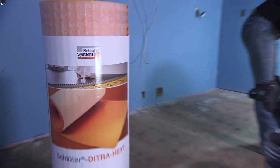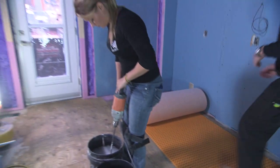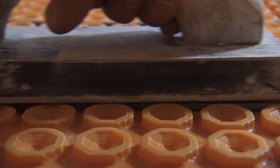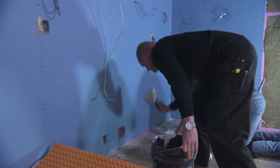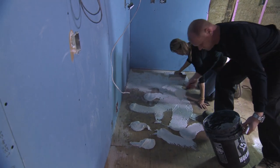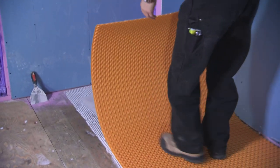Schluter's a smart company. The ease of putting in a heat cable system within the Ditra — called Ditra Heat — it's two things in one. It gives us that uncoupling membrane on the floor and allows a cable to be snapped in place, removing that secondary system, whether it's a mat or another cable system. The reason we want to uncouple the tile layer from the substrate is to allow the two to move independently. If you're not using uncoupling with a heated floor, chances are you may get tile cracking or grout joint cracking because of the fluctuation in temperature. And we're not doing the additional step of adding the self-leveler, so the installation is expedited.